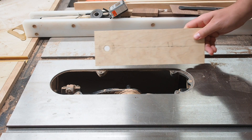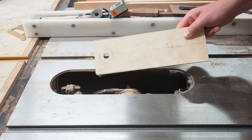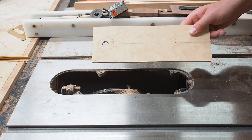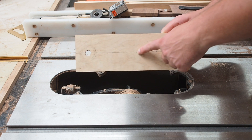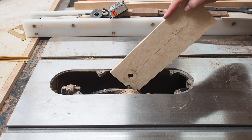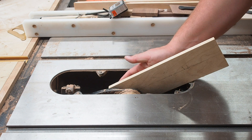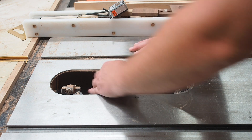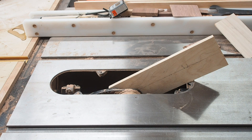So now I've made a test plate — just quarter inch or half inch Baltic birch plywood. It doesn't matter what you use as long as you can accurately mark your center line and where your gauge reference is from. Because even if this had a significant bow in it, as long as you're marking to the exact same point when you go front to back, your measurement should be the same. I'm going to go ahead and install this on my arbor — very carefully putting this nut on, because I don't want to go fishing for it.